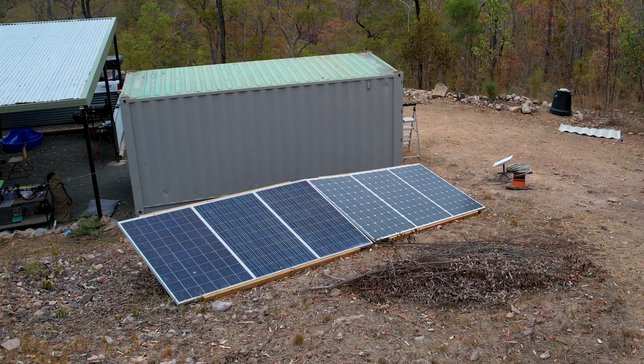For charging these batteries we are using solar and a generator backup. For the solar we're using the Victron 30-100 solar charge controllers — these are 30 amp charge controllers and they can handle the power brought in from the panels. These charge controllers are $350 each for a total of $700. The solar panels are secondhand house panels that Alicia's mother wasn't going to use — you can probably find a good deal on Marketplace, even $5 or $10 a panel. They run in parallel: two arrays of 750 watts each, with each array feeding one charge controller. Again, redundancy — I can disconnect a whole array or a whole charge controller and still have 750 watts flowing.